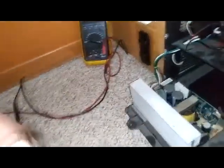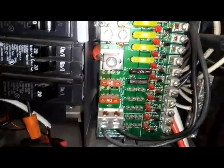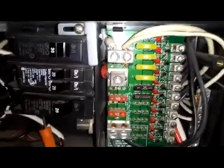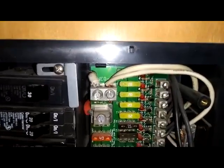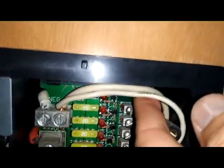Let me walk you through what I have found. I started checking the WF8900, the converter, and everything looked good there. Voltages were checking out good. I turned on the refrigerator, since that's the highest amp draw appliance that we have in the camper, and the converter was intermittently speeding up, slowing down, just doing all kinds of crazy things.